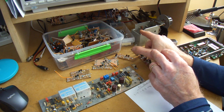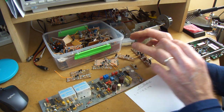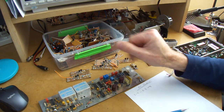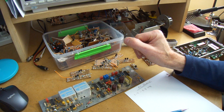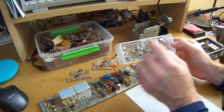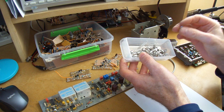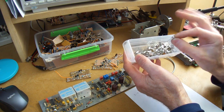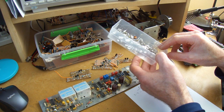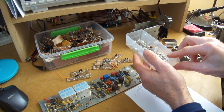Getting back to the VFO — I'll cover the build in the next video — following guidance from Solid-State Design for the Radio Amateur, I'll keep the VCC for the VFO quite low, around 6–7 volts, just to reduce RF current heating. I've also got polystyrene capacitors that I obtained many moons ago specifically for making VFOs, which have never been used. Hopefully they'll perform well to keep things nice and stable. I've also got some NPO ceramics, but I'll try the polystyrene first.